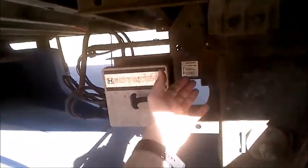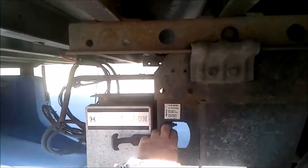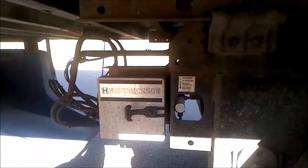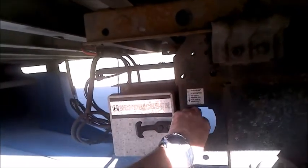By the same token, what happens is I pull the red brake handle out — the trailer brake handle out on the dash — and when I push it back in on the dash, it's the same effect as pushing this back in. These pins will come back out because it will reactivate the air back here. This is some kind of way to shut the air off that retracts the pins. In normal everyday use, as soon as you push the red one in, the pins go out. It's a safety, an extra added safety thing, so somebody couldn't just walk up here and pull this out when you're parked at the truck stop. As soon as you push the red one in, they're re-engaged back in the hole.